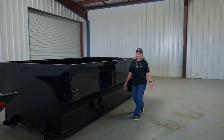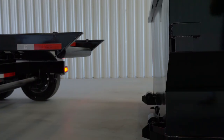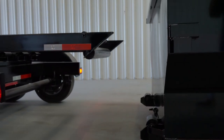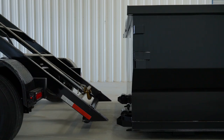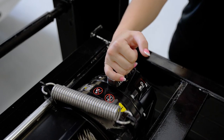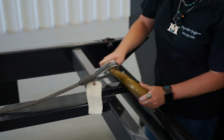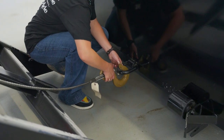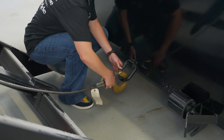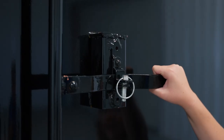You've got a dumpster that's ready for pickup and ready to hit the dump — so what's next? Start with backing your trailer up, making sure your winch is lined up with your dumpster's D-rings. You also want to make sure your tilt frame rollers are lined up with your dumpster's rollers. Disengage your winch and pull your cable past the length of your trailer. You can place your hook on the spear during the initial tilt, and then connect your hook to your D-ring.